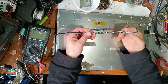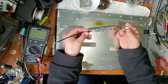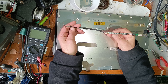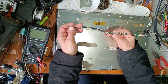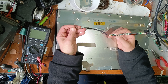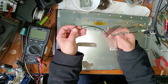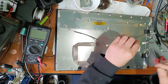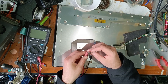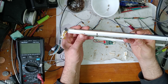In order to test these lamps, I've salvaged an inverter from an old laptop with a CCFL backlight. It has four wires: ground, plus, on, and dim pin. The orange wire is ground and black is plus. I put a 1 kilohm resistor and tested with 12 volts from my power supply — it showed 400 milliamps power consumption.